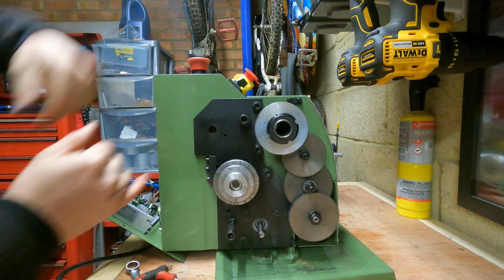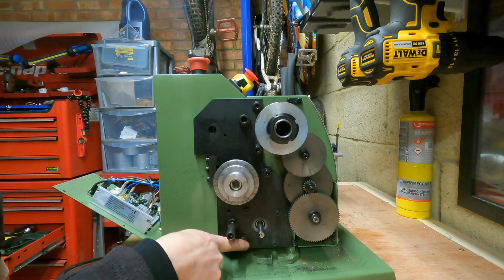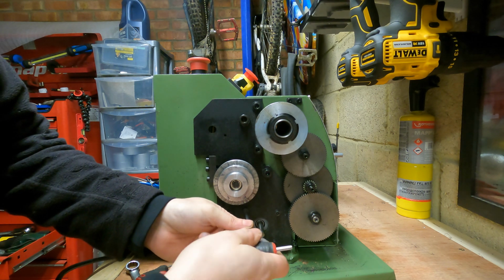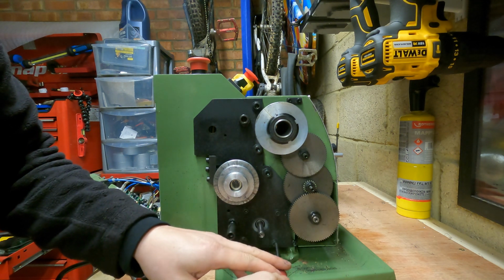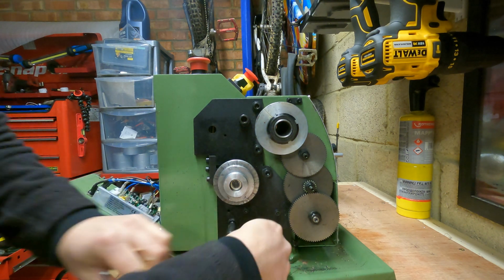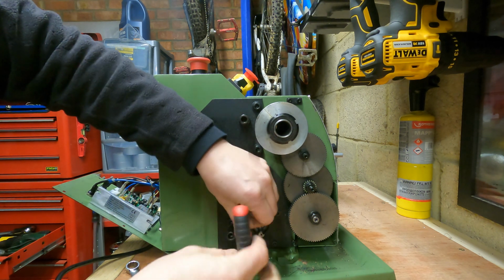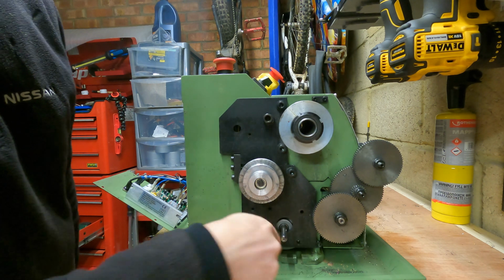Right, so you've now got these 6mm cap-headed bolts. They hold this big black plate on, and at the bottom you've got 4mm cap head bolts. They basically hold the motor onto that. So I think I'm going to start by undoing them. Crack them off. That should, after they're undone, make the motor loose. Yeah, there you go. So that motor is now loose on there. Because it's a flanged motor, it bolts on there. Some motors will bolt on underneath, but this bolts on here. So shall undo them. So we now have one loose motor.